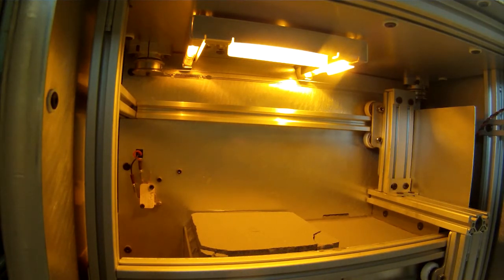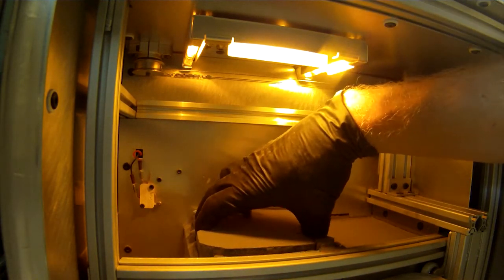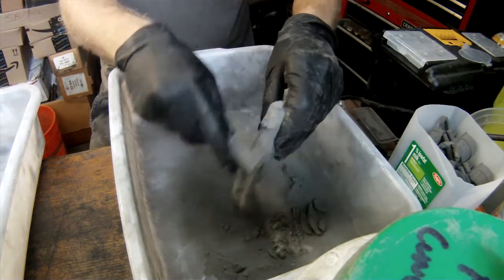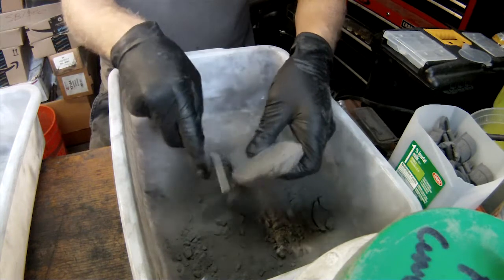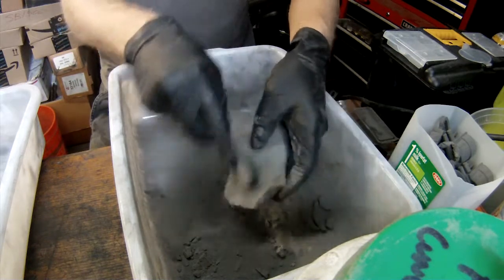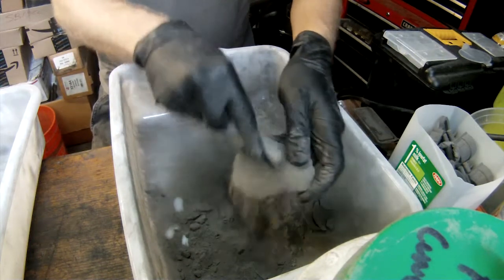There's no guidebook on how to do this. 3D Chimera gave me a great starting point, and their numbers actually do work really well. I was just trying to fiddle with it a little bit since this print is just a fun little print — nothing crucial on the line. I used their parameters and they were slightly a little bit bigger than what I liked for my company settings. So I'm trying to adjust those parameters a little bit smaller so I can use what I did here on some company prints, which do need to be exact — they have to be the same thickness as the standard settings. Otherwise, the parts don't interconnect; they'll either be fused together or too loose. So this is just my test run to try out some of the different parameters.